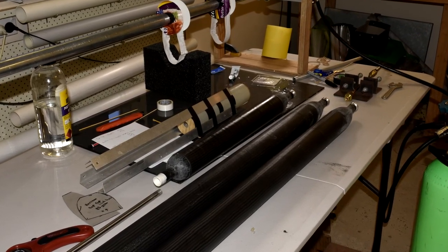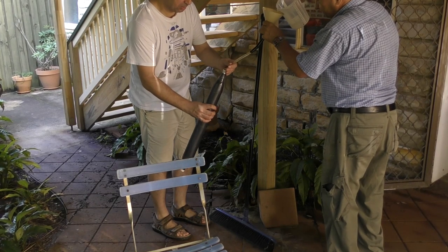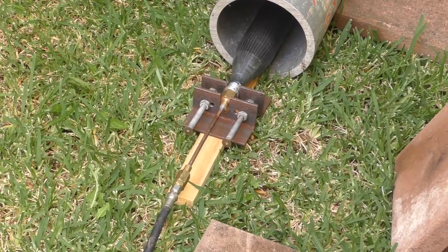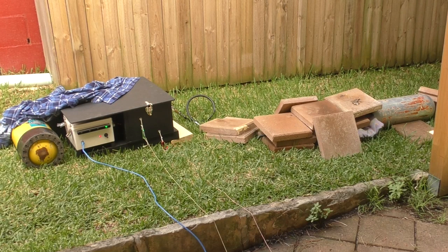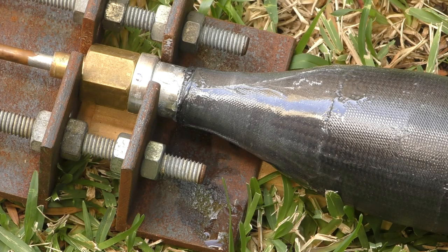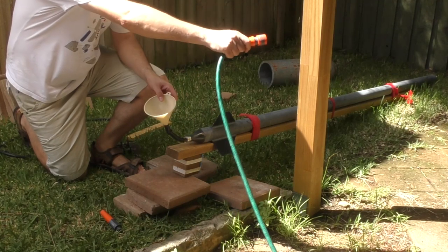Next it was time to do some pressure tests. We had built a short test pressure chamber using exactly the same construction techniques as the actual pressure chamber but with the lighter carbon sleeve, to find the upper pressure limit. We did a hydro test by completely filling it with water, placed it inside a scuba tank with its bottom cut off, connected it to the air adapter from a previous video, and hooked it up to the Horizon launcher. We piled pavers on top to minimize free-floating debris should it fail. We pressurised it to 1250 psi — it held up well, though we noticed a couple of small drops emerge around the nozzle at full pressure. This would have been totally flyable, and the improvements in construction technique looked like they worked.